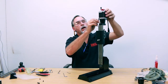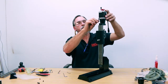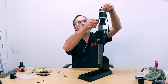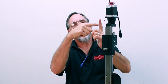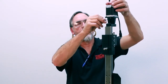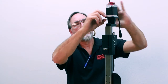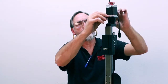What I want to do now is slowly tighten the set screw onto the shaft. Once I feel contact, I'm going to turn the hand wheel slightly to make sure I'm perpendicular to the flat — not off at a slight angle at all. Go perpendicular to the flat, then back it off a hair. Before I tighten this all the way, I want to sandwich the stepper motor and the motor mount together first.